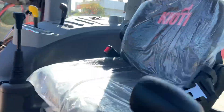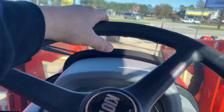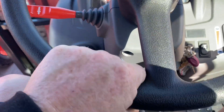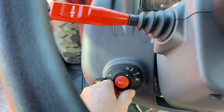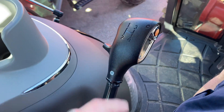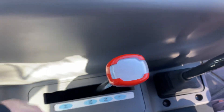Jump in on this side. So when you're sitting down, you do have a little right under here — you'll grab that and that'll be your tilt wheel so you can feel comfortable and it'll run smooth also. Got a little horn, turning signals, high and low beam headlights from right here. It's going to be 12 forward, 12 reverse in your gears. So that means you've got your 1, 2, 3, and 4, and you've got your high, low, and medium ranges right there. Clutching is pretty simple. Got your neutral.